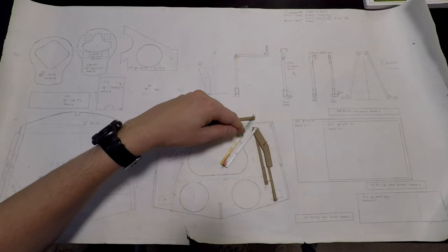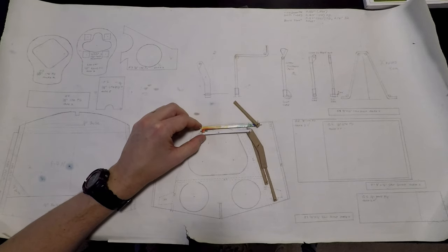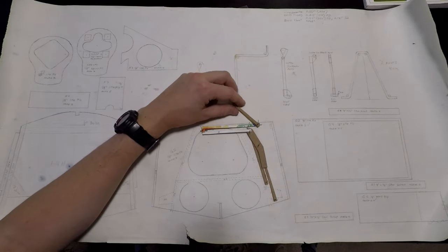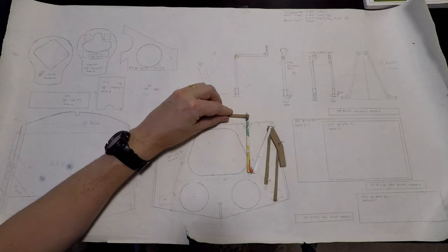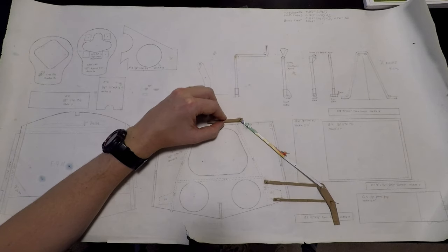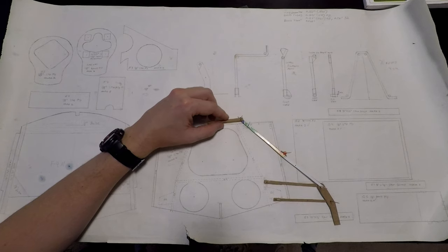In my design I have the upper and lower support arms stopping in the middle rather than swinging all the way up like Grumman does. But this means the upper arm only rotates 90 degrees to get through the full range of movement of the gear. Most programmable digital servos can do up to 180 degrees of rotation, so I get a kind of 2-to-1 gear reduction that gives me even more torque to bring the gear up.